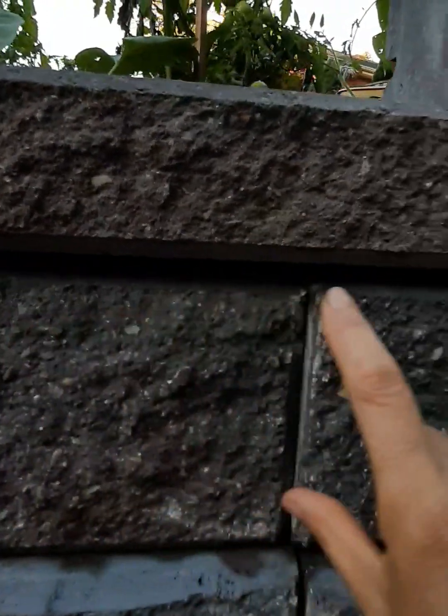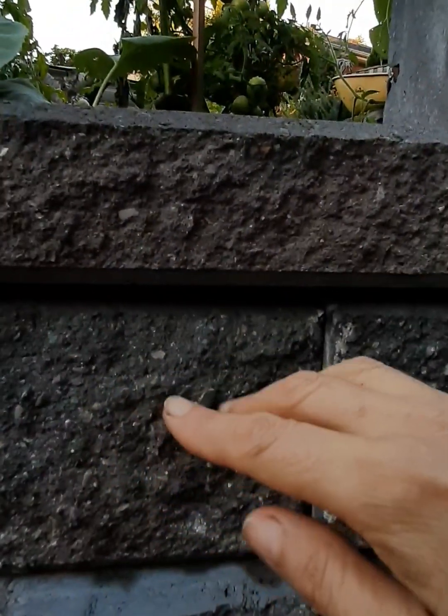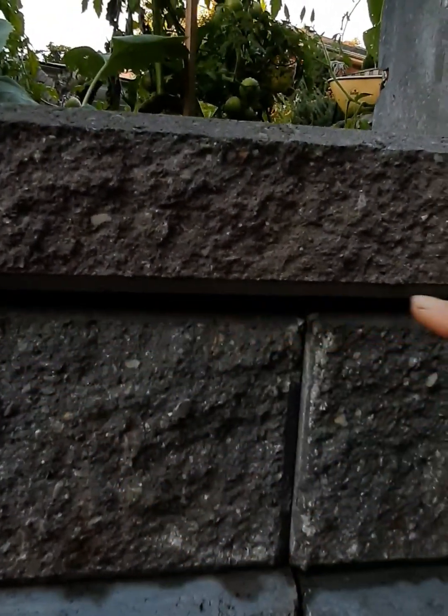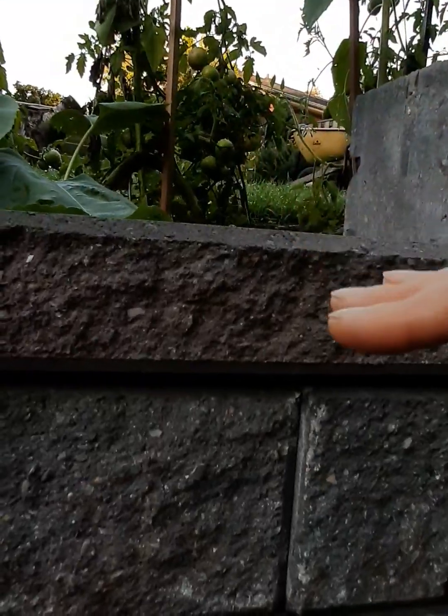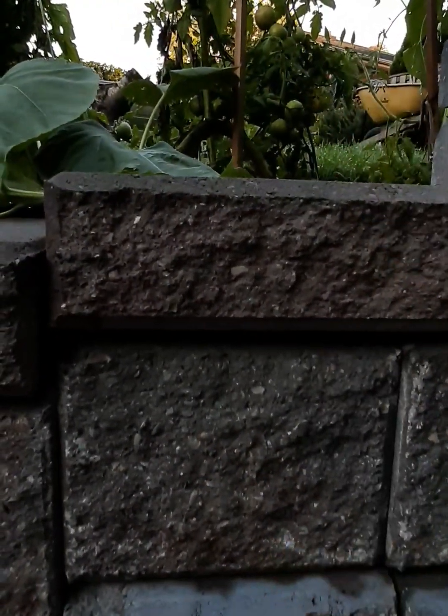First you dig the trench, then you bury this inside, and you set all those 3 blocks in here. You have to use a level to make sure it's level this way and this way in the depth, and you set them with the mallet, you bang them in so they're all nice and straight. And that's your first course. Now let's go look at the stair again.